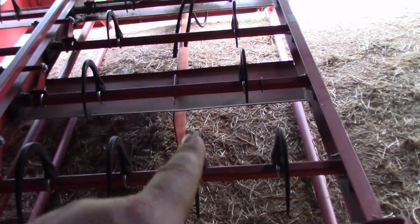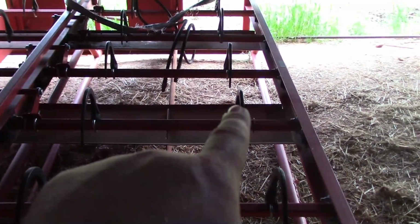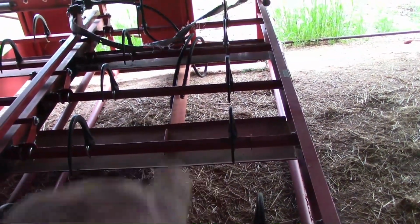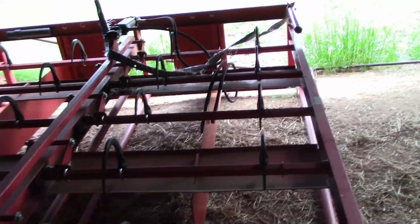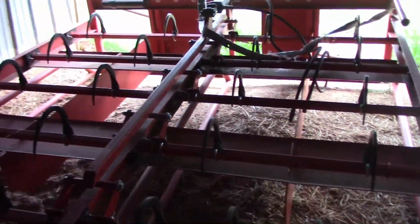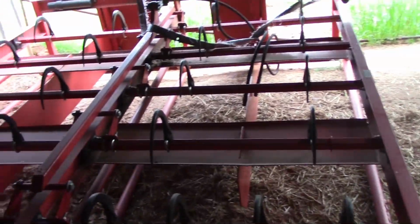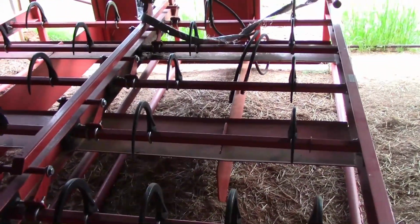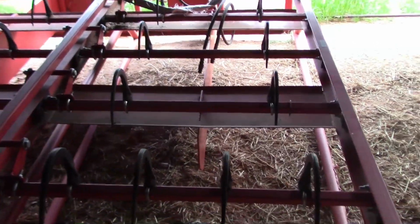Now it may be a little bit harder running your bales in, but your hooks, when you pull your pieces off, ain't gonna be as far off, and it's a lot easier to use one machine with that one, because you could do like I'm doing right now. You could accumulate it, set your hooks, tote that group to the trailer, set it on the trailer, go accumulate some more. With the new one, now with this one you can't do that.